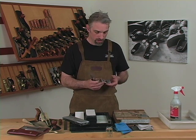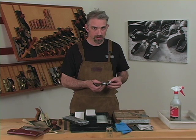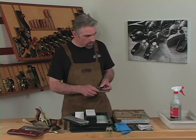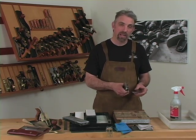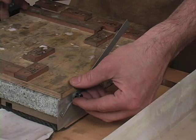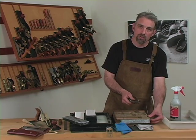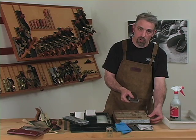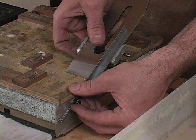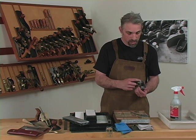If you're going to be using a different style of jig that may require different measurements for projection distances, or you simply want some different angles than the ones we've provided, set a protractor for the angle you like. Hook that protractor off the bottom of a parallel surface like this plywood, which creates a fixed angle. The blade should shift in your jig but still hold position. Slip into that corner created, and when it intersects with the arm of the protractor, you've determined the projection distance for that angle.